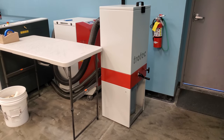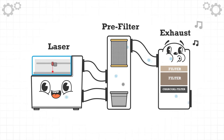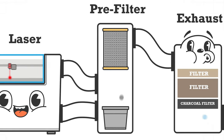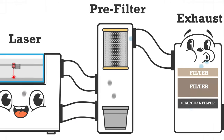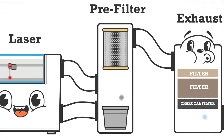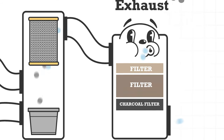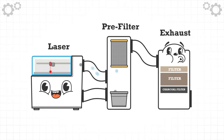How the system works is really simple. The laser exhaust enters the pre-filter unit, moving up into the round filter. As air is forced through the filter, dust is trapped inside. The air that comes out has been mostly cleaned of heavy particles. What remains — the more microscopic particles and stinky gases — moves into the exhaust filtration cabinet for further filtering, leaving you with nice clean air exhausted back into your workspace.